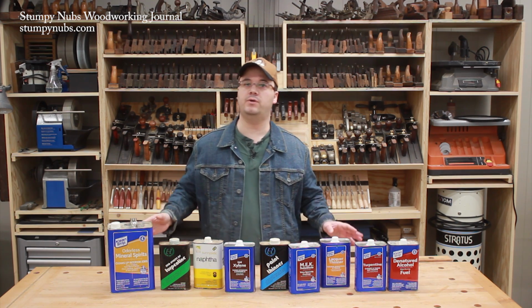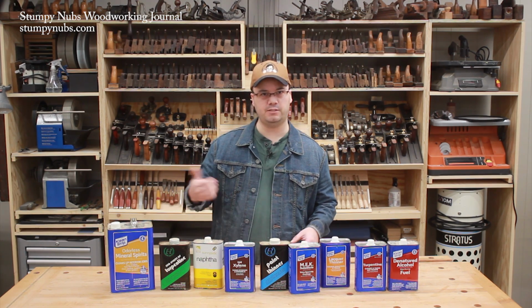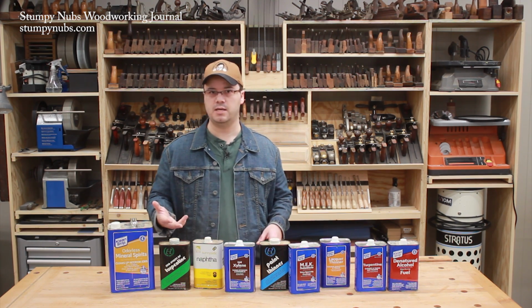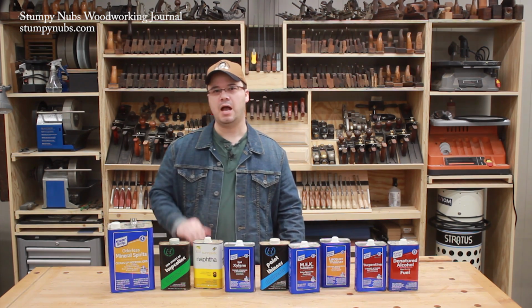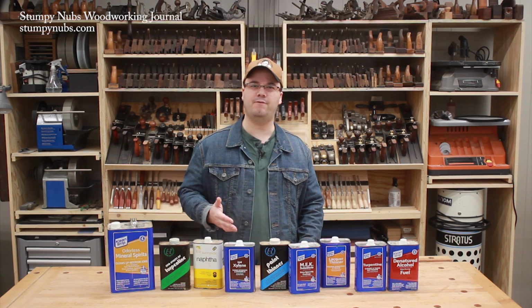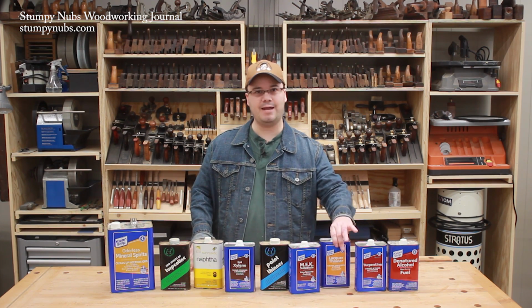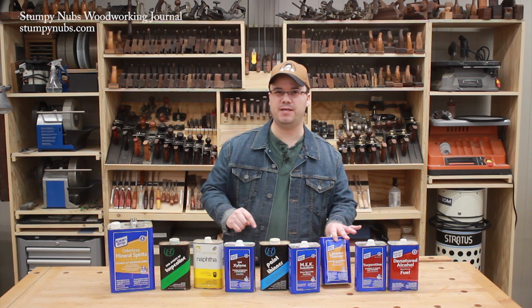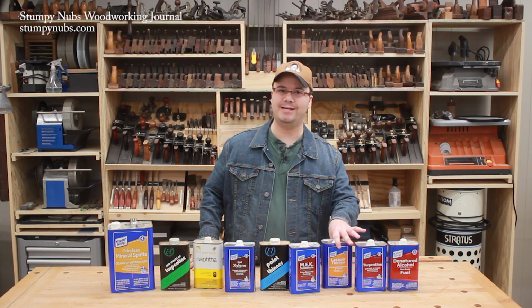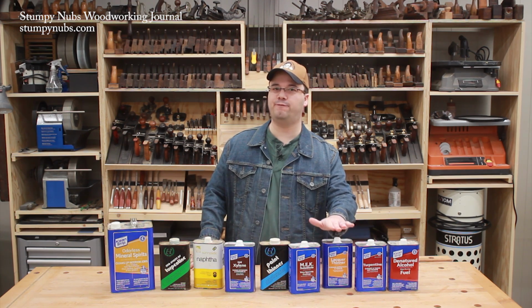So they are not all created equal, though the base ingredients are pretty much the same. You have some ketones, some esters, some alcohols, some glycol ethers, and I think I smell a little dash of rosemary. A discussion of lacquer thinner is better left for a tutorial about spray finishing because it's a big subject. But if you see a can of lacquer thinner on the shelf at a hardware store, it's probably the cheap stuff that's mostly xylene or naphtha, and it's intended to clean spray equipment, not to properly thin your fine spray finishes.